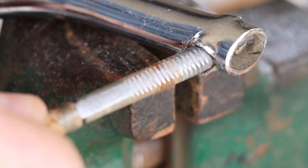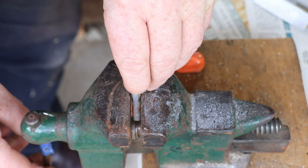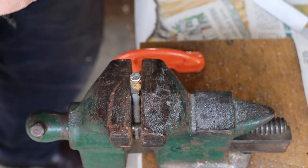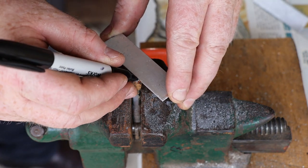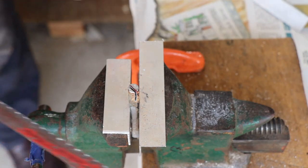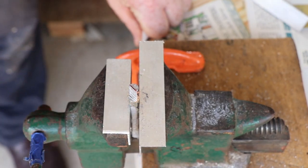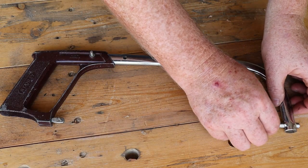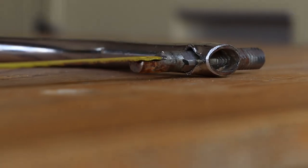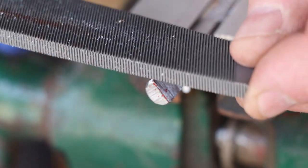Once the first side's been filed flat, flip it over in the vise and file the opposite side in the same way. Now that we've got two flat sides on the bolt it's much easier to align it in the vise to file the remaining sides. Keep filing those sides until the bolt slips easily into the hacksaw frame — the round section shouldn't fit through the square hole. Now we can hold the bolt vertically in the vise, mark two of its opposite corners, then mark a diagonal line across the end — this will be the rebate on the tensioning bolt where the hacksaw blade sits. I'm cutting the rebate out with the hacksaw but you can file it if you prefer. Let's assemble our new bolt in the hacksaw and take a look at the alignment.